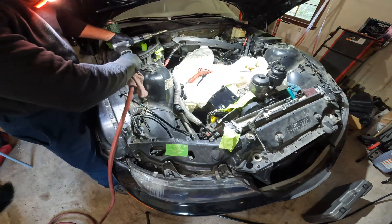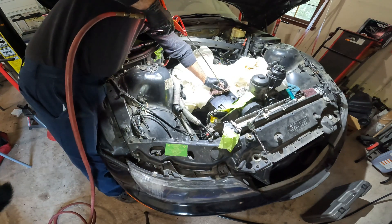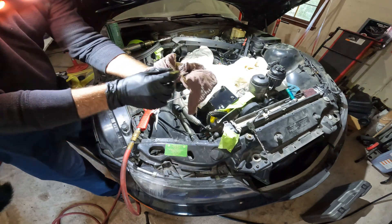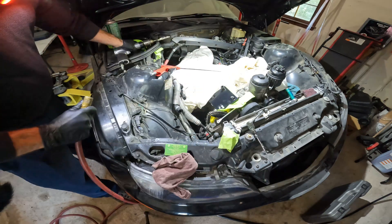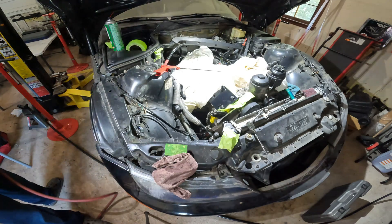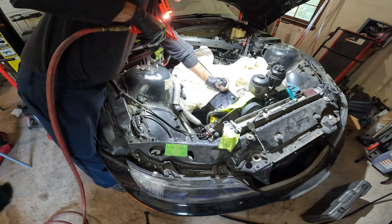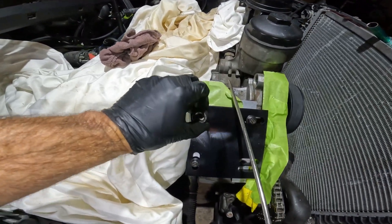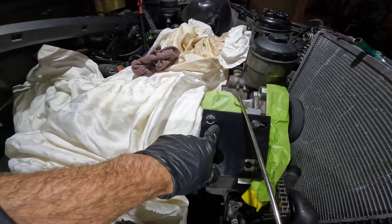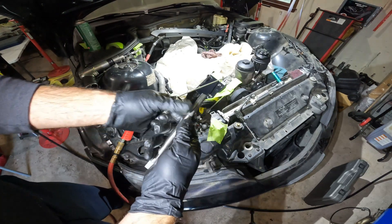I'm all the way at the bottom, so now I'm going to blow out the chips. Make sure you have safety glasses on, cover the hole. You can see all the swarf right there. I want to make sure there's no metal on the drill when I'm done — remember, spray and lubricate each time. Blow it out again. Now you can see it's drilled nice and straight and there's no threads — it's just a blank hole.